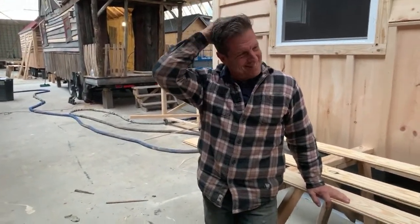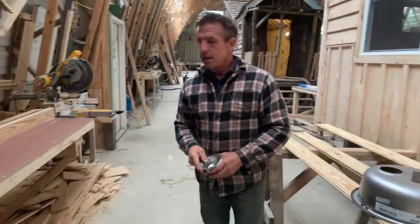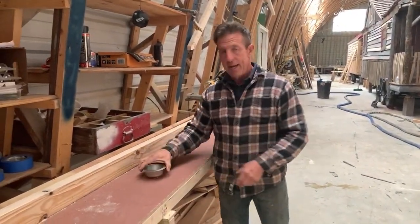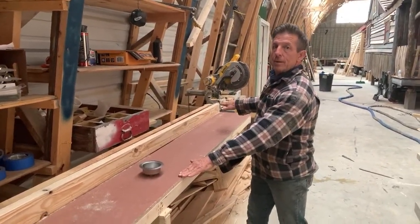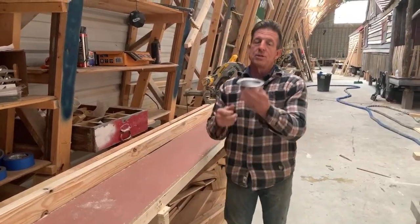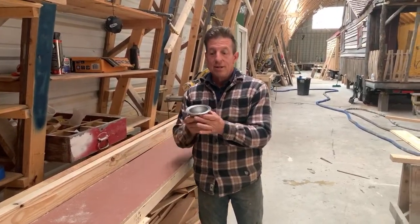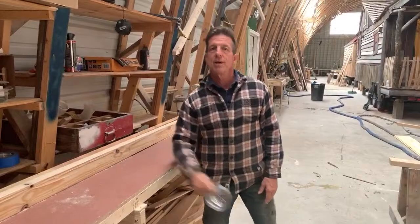Clean your house. And then the other thing, Maria asked, how do you do the trough tubs? So you have to try and make that indentation? Well, the trough tubs, what we do is we take the drain, and let's say the trough tub's long. We put the drain at the end, and we lift it up. So you have to elevate it so it'll drain out that water. Yes. This will still be up somewhat. So when you're in there with your pretty little feet, and you want to put your little toes around the drain, just watch out for that little bitty lip. But the majority of your whole body is sitting here. But that's what we have to do.